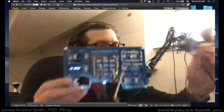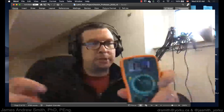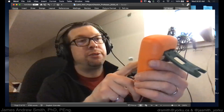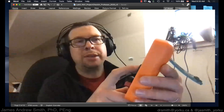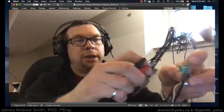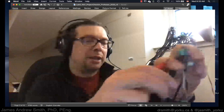Now we can use a multimeter to verify the connections. I've set the dial to 20 volts DC — that's a solid line and a dotted line on the dial, though it may look different on your multimeter. I'm setting it to 20 volts because the power supply will be somewhere between 5 and 12 volts. I'm going to take the leads and touch them to the screw terminals on the power supply side.